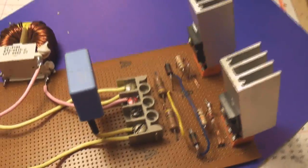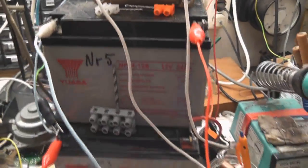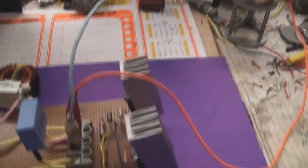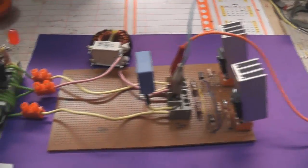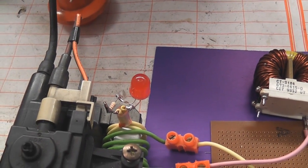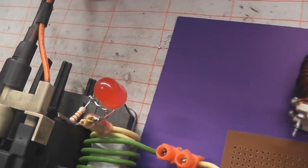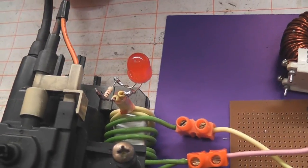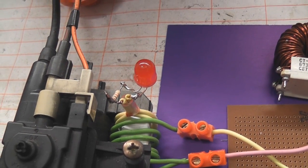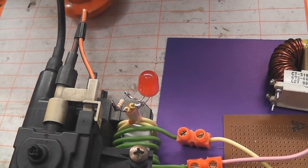I'm gonna give this device a test. The power source is just a 24-volt battery, connected up to the ZVS driver and a TV flyback transformer. A handy thing I found — I made up a simple on/off indicator: basically two turns extra over the ferrite, a one-kilohm resistor, a blocking diode, and a standard LED.